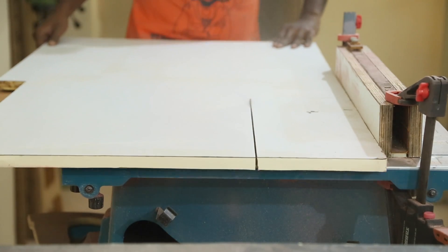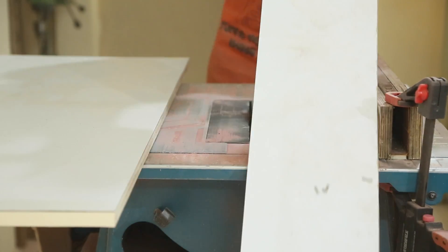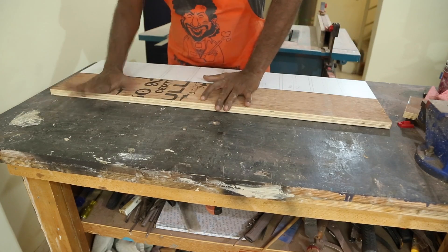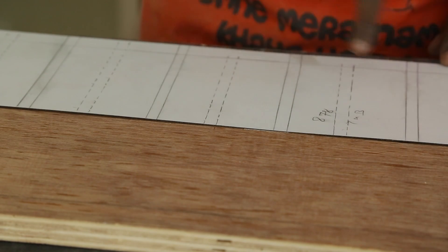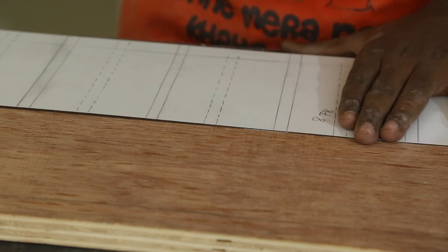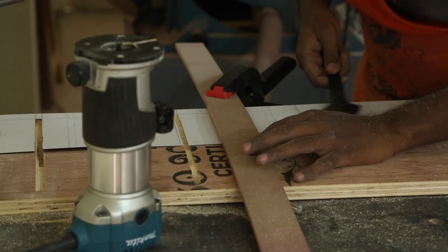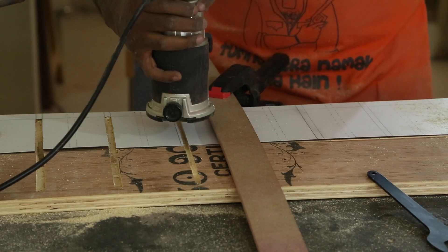To create the casing to hold the rack I used 18mm plywood. I stuck double-sided tape so I can create dados using the router. I transferred the box measurements to mark where the dados are required — the solid lines are where the dados go and the dotted lines are where I keep the fence so the router can ride along. Because my router bit wasn't wide enough, I had to nudge the fence a little bit to create the correct dado width.